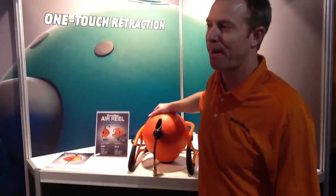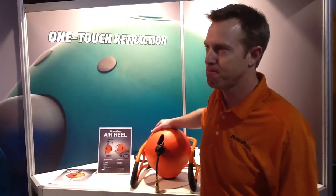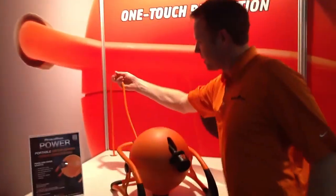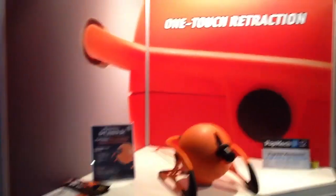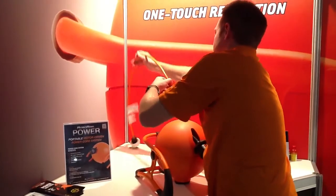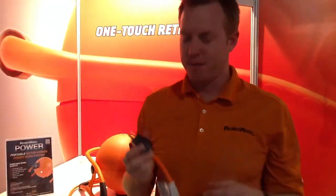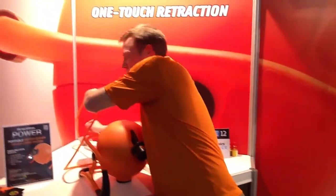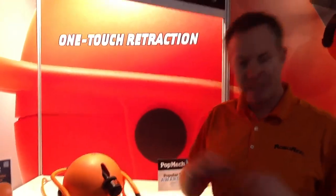So talking about the actual electrical line that comes out to my boat — how do I hook that up? You can just plug into the back via a six-foot pigtail. There's a breaker on the end, so in case of over-amping, you just press this end if you've over-surged or overloaded your circuit. Outstanding. And this thing will shut power off if it overheats — so if you had an old battery charger that ran away from you, this thing will protect you from burning your house down. It will automatically shut off. Just like if you sever the cord, it kills power immediately.